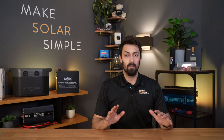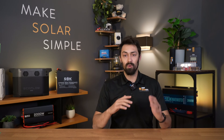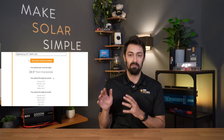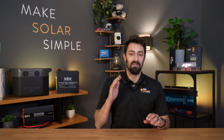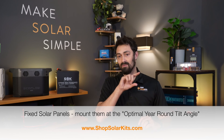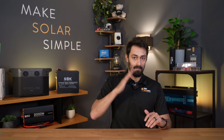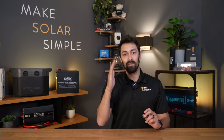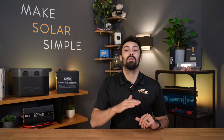I hope that video was useful. One of the most common questions we get every single day is what angle should I be putting up my solar panels at? So we went ahead and created the solar panel tilt calculator so you can just put in your exact address or zip code and it will give you that angle. Two things to remember: if you have a fixed-mounted solar panel and you're not going to be able to change its angle again, you're going to want to mount it as close as possible to the ideal year-round tilt angle — that's the first calculation our calculator will give you. If you're lucky enough to get a ground mount or a mount you can adjust, you'll be able to go out four times a year and change the angle to maximize your output. If you have further questions you can always reach out, check the solar hub as well — I'll link everything you need below.